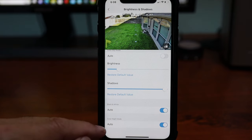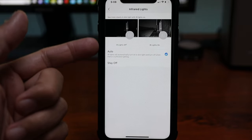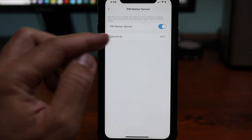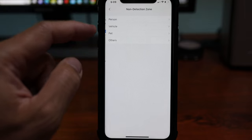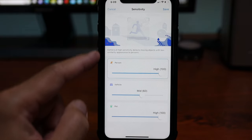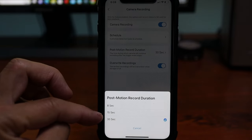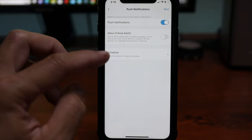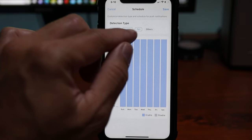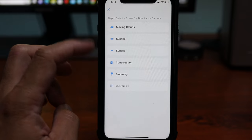There are separate settings for black-and-white infrared and color night vision, privacy mask with up to three privacy zones, and light controls for the infrared LEDs (auto or off) and the spotlight — which can turn on when motion is detected at night or stay off, though there's no brightness adjustment. Under motion sensor settings you can adjust sensitivity and set detection zones, with separate settings for people, cars, and pets, including adjustable smart detection sensitivity. Camera recording lets you schedule which events get recorded and set post-motion record duration. Push notifications can be scheduled independently from recording settings — I really like that you can dial in and customize recordings and notifications separately. There's also a timelapse feature, though I recommend hooking up a solar panel since it drains battery life.